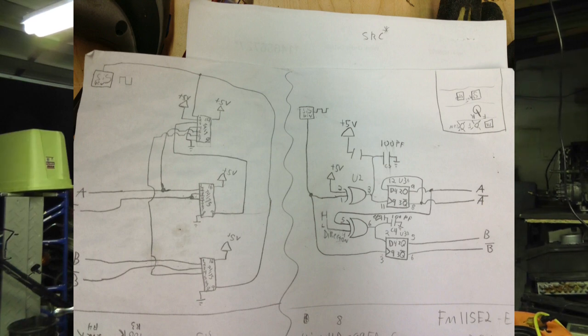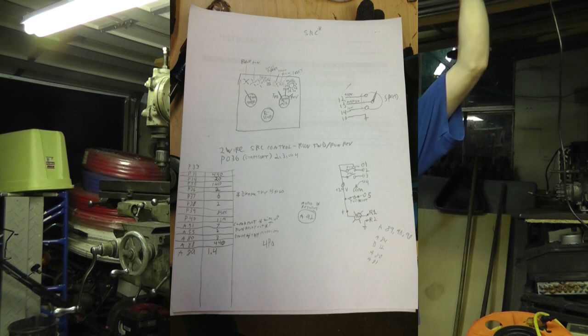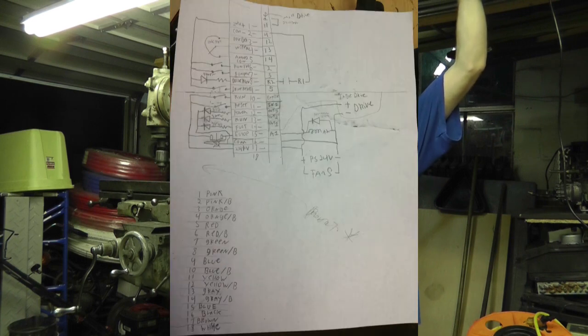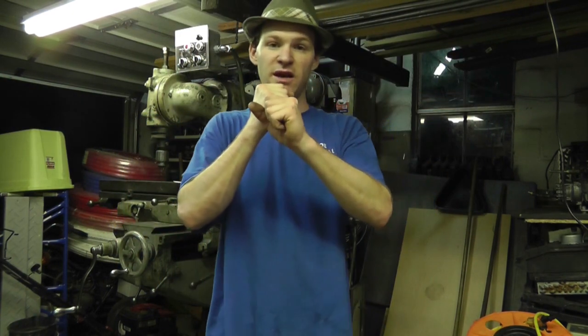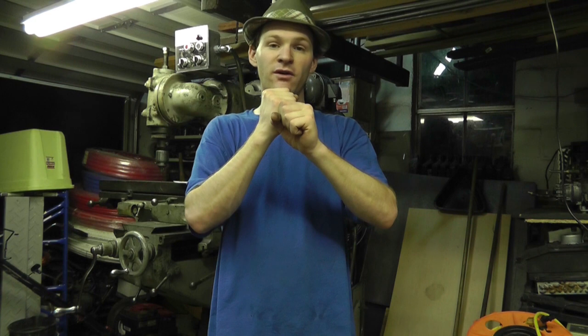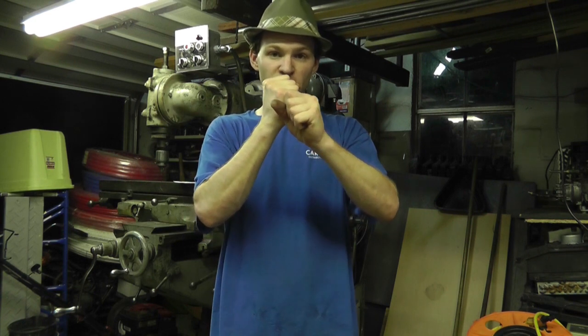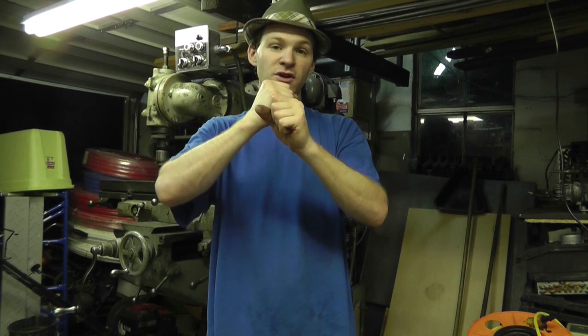That's pretty good. So when I flip the switch, it disconnects the capacitor and opens it up to charge the capacitor, and it turns the drive on and tells it to be active. Now here's the interesting part. This servo drive is trying to hold its position, okay? So you have the motor and the encoder. They're tied together in a solid shaft. When you turn this drive on and you say don't move, it tries to hold the position wherever the encoder is, okay?